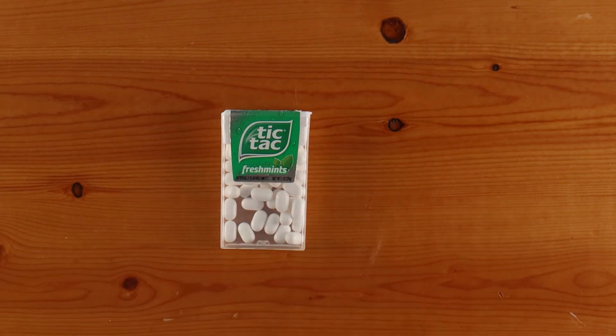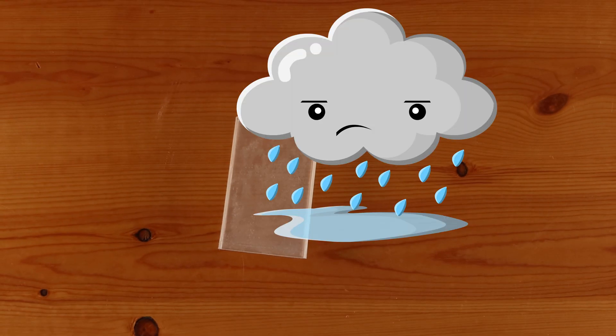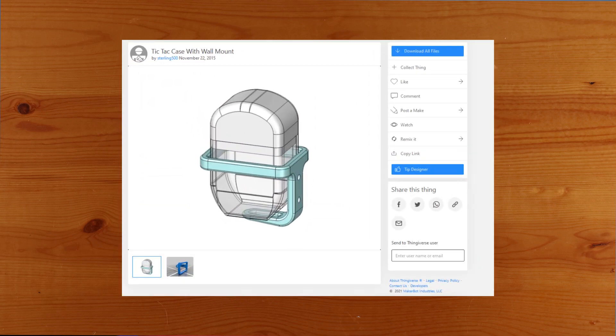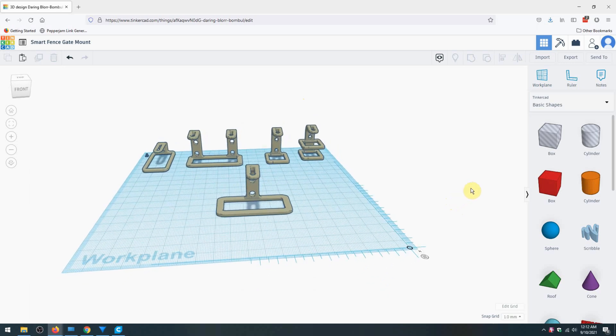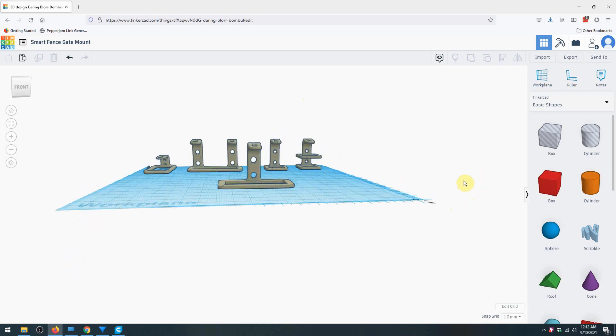With the sensor picked out and set up, the next step was making it so it could actually last outside for more than a few days or weeks. Instead of commercial or 3D printed enclosures that were too bulky, what I ended up doing was using an empty Tic Tac container flipped upside down. The hard plastic shell is perfect for keeping moisture out and not too thick to interfere with the magnet for the contact sensor. To mount the Tic Tac case I found a 3D model for a Tic Tac mount that would normally be used to hold actual Tic Tacs on a pegboard, and I had to make a few adjustments for the wider top of the Tic Tac container to fit through, as well as make the opening a bit smaller and the screw holes a bit larger.